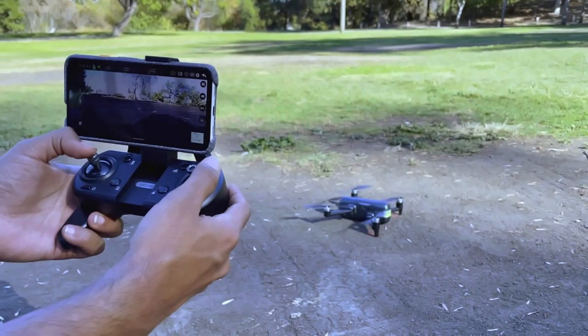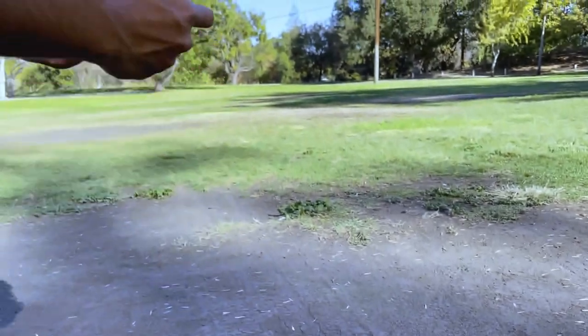Once calibration is done, you will see the video feedback from the drone. You can then turn on the remote by pressing the power button — you'll see a blue LED blinking, meaning the remote is on but not yet connected. To connect, press the left joystick up and down and you'll hear a sound sequence confirming the connection, and the LED will turn solid. To start flying, move both joysticks to center; the motors will engage but the drone stays on the ground. To fly, push the throttle joystick up or use the single takeoff and landing button.